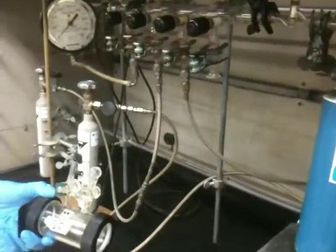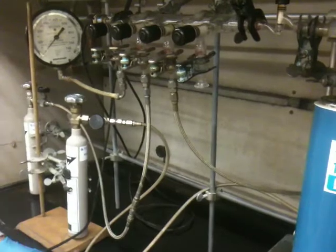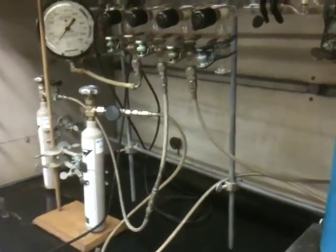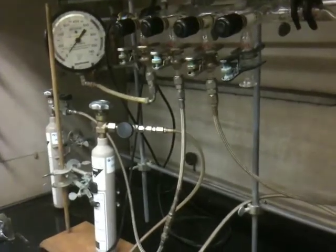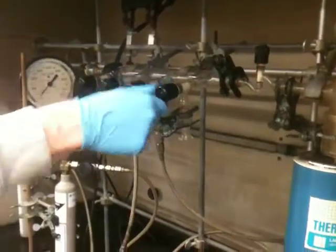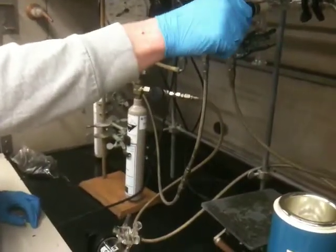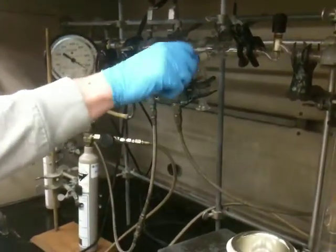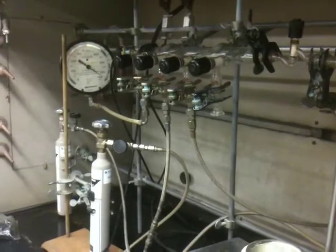Any questions? It's a lot to make sure we don't put too much gas in anywhere. Student question: if the pressure goes beyond 200, what do you do? If it goes beyond 200, I would start over again. When you're done with that gas, take off the trap and vent this to the air — you'll see the gauge catch atmospheric pressure. Then when you're ready to start again, re-evacuate.